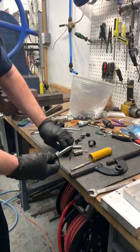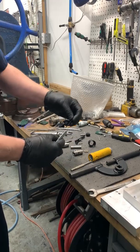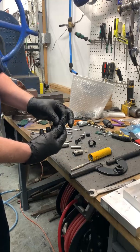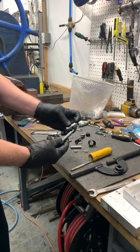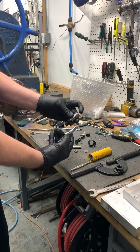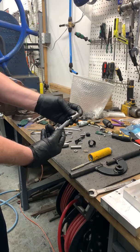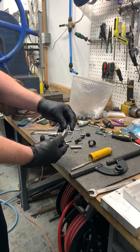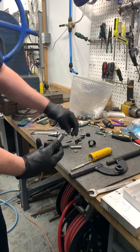Okay, so now reassembly of the motor. Install the blades, and then the cylinder, and be sure the notch is towards the bottom end, the back end of the rotor. That's the front end, that's the back end. Here's the notch. I don't know if you can see it, but you'll see it on the cylinder. So you put the cylinder on, and then the rear end plate, the flat side down. There's an opening for grease and oil for a place to go, the flat side down, inside of the notch.